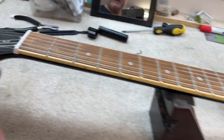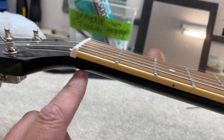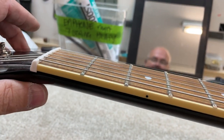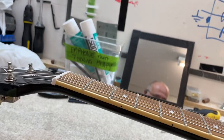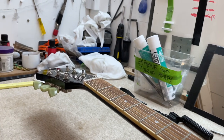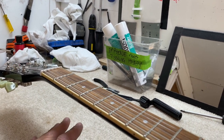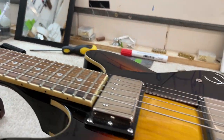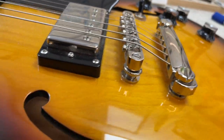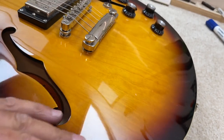That one, we discovered a surprising and unexpected crack where the headstock had taken a whack, and it was cracking the wood on both sides, and I was able to lever it open and put some glue in it, and smooth out the finish, which is great. So that's stable. This one has none of those problems that I've seen so far, although in every other respect it's very similar. Slightly lighter fingerboard, obviously a different finish, but equally nice.